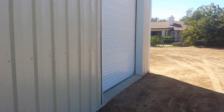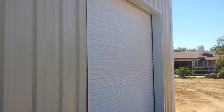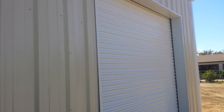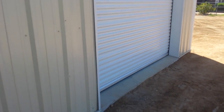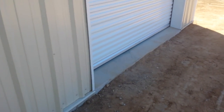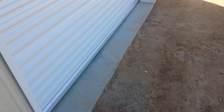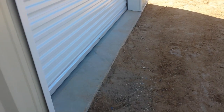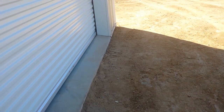What I wanted to focus on in this video is our roll-up doors. This door right in front of us is a 10 foot by 10 foot coiling overhead door. It rolls up on a drum at the top of the door. You can see out here on the edge of the concrete — the way we do our details, we slope that edge so from the face of the door out it has a little bit of positive slope away from the building. It gets the rainwater and other things running away from the building.